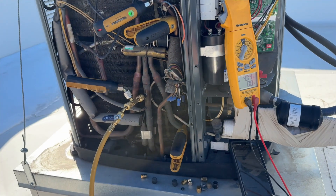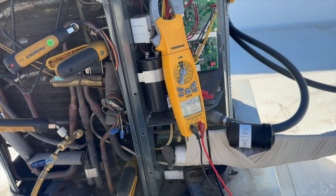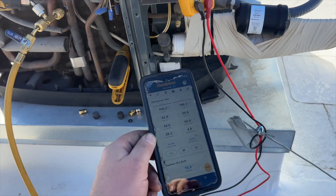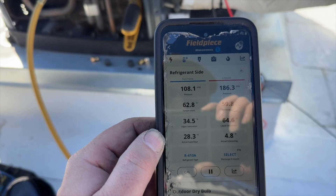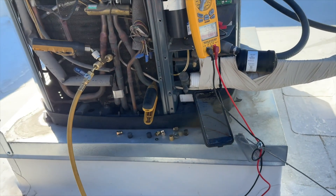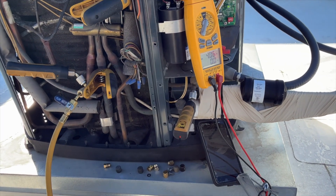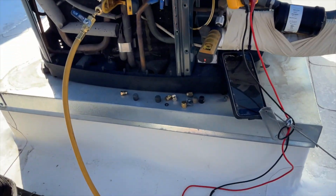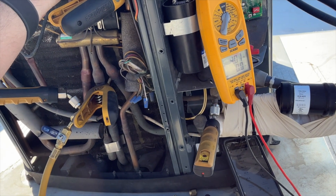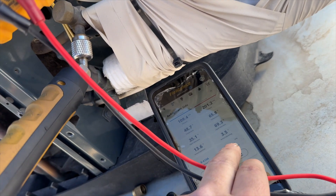It's pretty cold today so it's going to take a while. I'm keeping an eye on my pressures and my amp draws on my compressor, because my compressor sounds terrible right now. Amp draws are about the same. Pressures have gone up a little bit — we're at 108 on our low side and 186 on our high. Subcooling is at 4.5, so it has increased, and that's with one pound. I'm going to let it run because it's 410A. I just realized I had this probe on the discharge line — that's why my subcooling went up a little bit. Whoops. Now that it's on the actual liquid line, I'm getting about 4.